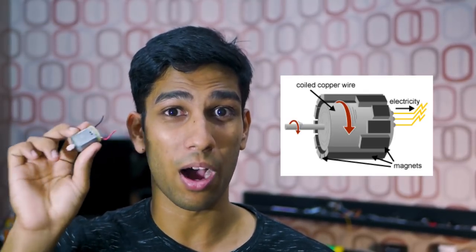We learned that providing a voltage to the motor will cause it to spin — but what if we don't provide voltage? Imagine an electric car going down a hill: we're not accelerating, but because of the hill the electric motor in the wheels runs faster and faster, which actually creates a voltage. The electric motor now becomes a power generator. This is called back EMF, and by adding something as simple as a diode we can protect our circuits against this voltage coming out of the motor and damaging them.